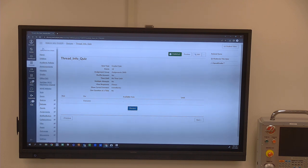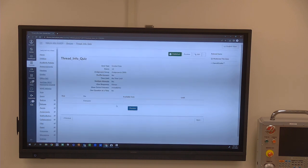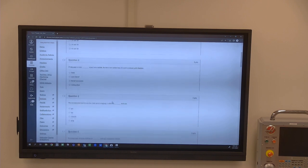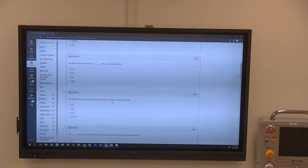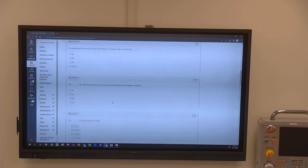On this ring hole, do we have a D drill at all? Find what we have that is closest to it. Closest to it, so a quarter inch? You're reaming at a quarter inch. Yeah, that's what I thought. So you can ream at a quarter inch. So I need to be at 0.246, D. I'll see if I have it. We've got a D drill. Yeah, I just want to make sure we're good.